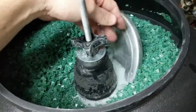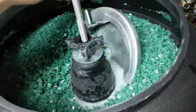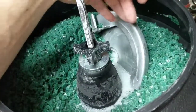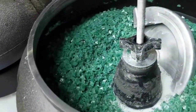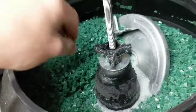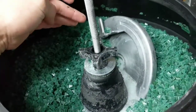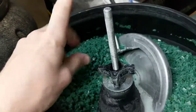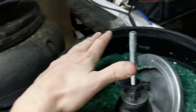And so they slowly float around and scrape up against the sides of this thing, and over hours or days take all the dents, divots, and scratches and scrapes and kind of knock them down. Now, it's not a fast process by any means. It depends on the grit. These are the real fine ones. You want much larger, much coarser ones if you were making any kind of money doing this, but I just wanted to buy one thing to get a good finish, and I have all the time in the world, and then I got another one because it wasn't fast enough.